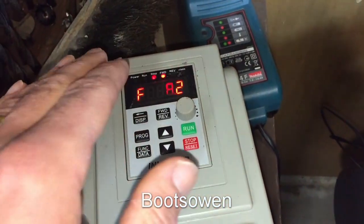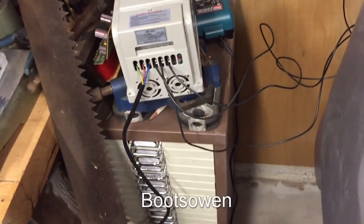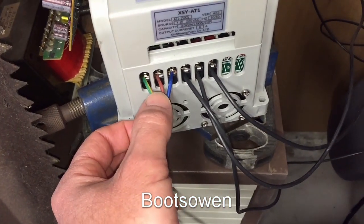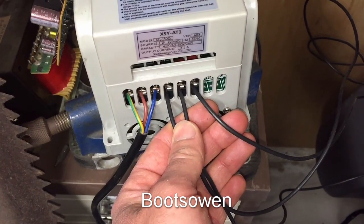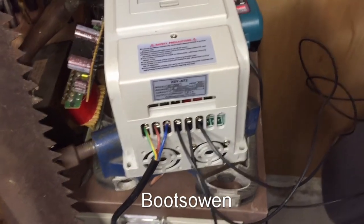It's not flashing in real life, it's just on the camera. But this is a useful little inverter, and it's a useful way of getting a three-phase motor that's only got three connections on it to run. It's really simple to wire — you put the regular electricity in over here, and you take the three phases out here.